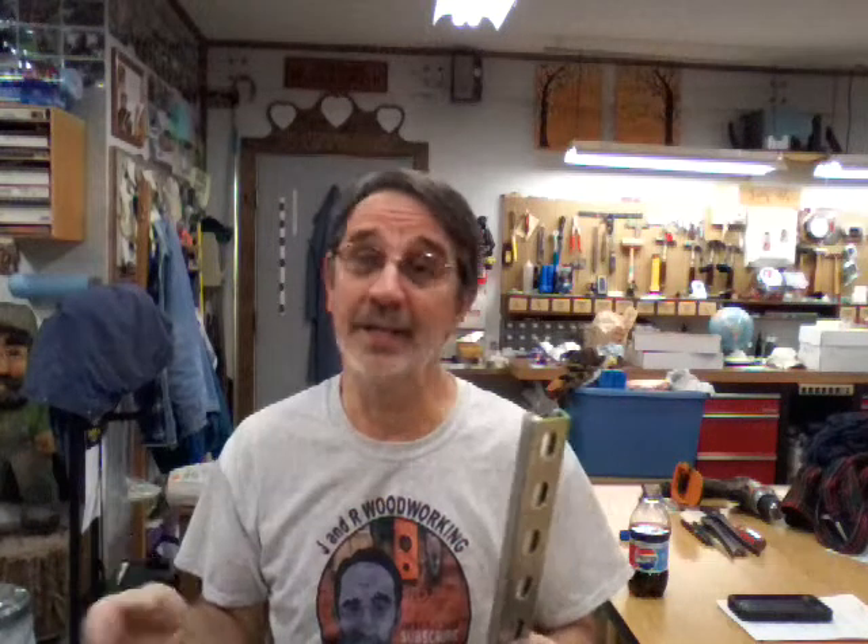I had to hit the trusses in the ceiling to get it anchored to something solid. This is a plastered ceiling — you do not want to hang this with little plastic anchors in the drywall. Too much weight. You want to anchor it directly into a truss or something solid up there.